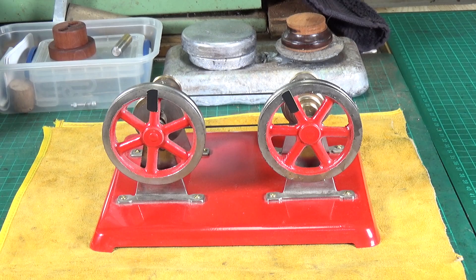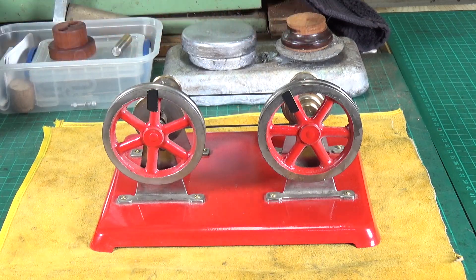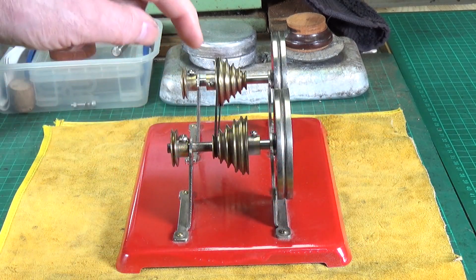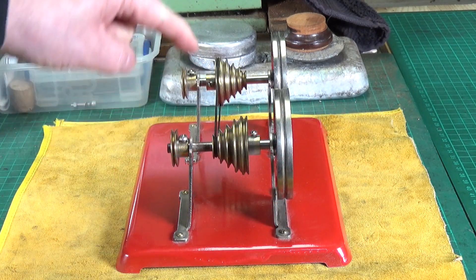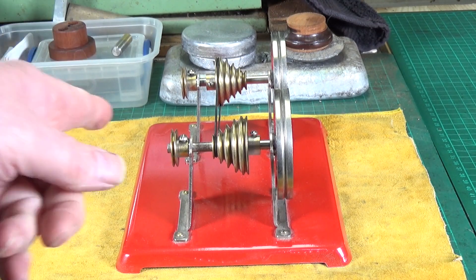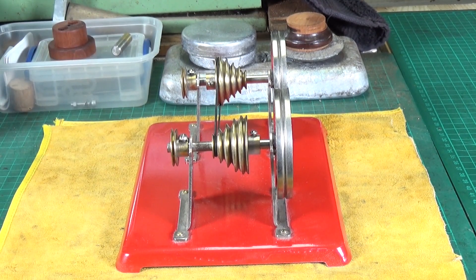So the confusion with Rob's video was that when he changed to similar-size pulleys, the generator appeared to speed up — that's not really what should be happening. I'll do one more demo. This time we're going to be driving from a little pulley to a big pulley, which is gearing down. So I'll turn it round and we'll demonstrate that.